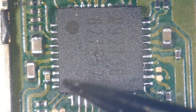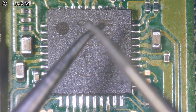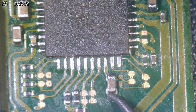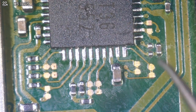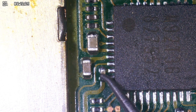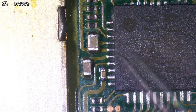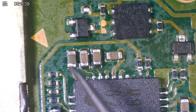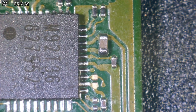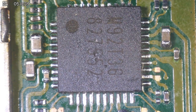I'm going to reflow this chip and put it right, because it's not sat right at the moment. But before that I'm going to get my multimeter and check for any shorts we currently have. I have my multimeter in continuity mode — when I touch these two probes, we get a beep. I'm going to start with the CPU cap down here: black probe on ground, and we test. Okay, that's fine. If this side was shorted to ground, we'd be in serious trouble — game over. No beep on that one. Beep on that side though — so we have a short on the P13 cap, which means the chip on the other side of the board also has an issue. This one's fine. All the top ground caps are fine. These ones aren't meant to be ground and they're all fine. I'm going to play this confident and reflow the M92 chip.